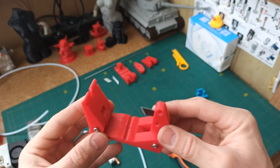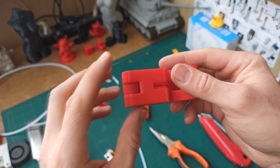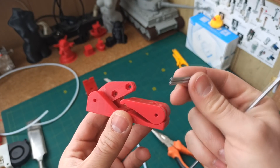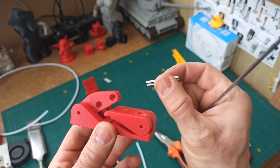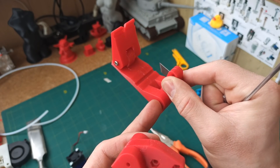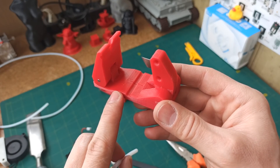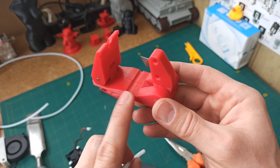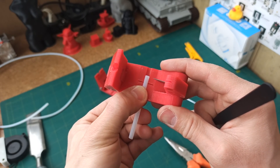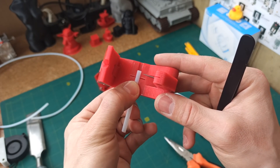Let me show how to assemble it. It consists of three parts — insert the clamp here. I calculated the tolerances so everything fits maximally tight. The lever goes on the same side. To connect the elements I'll use a 3mm bicycle spoke — I cut two such shafts. You can also use regular M3×35 bolts instead. Now it all looks factory-made. Just put in a piece of blade. When using this device and similar ones, there is one important feature: you cannot trim just a tiny bit of the tube — the tube must be inserted at least 5mm deep for the cut to be maximally precise and perpendicular.